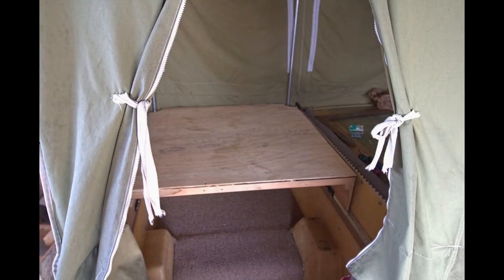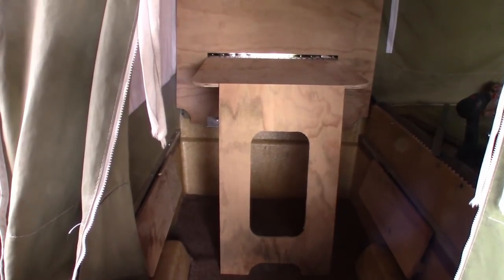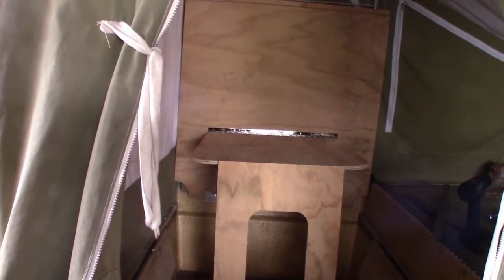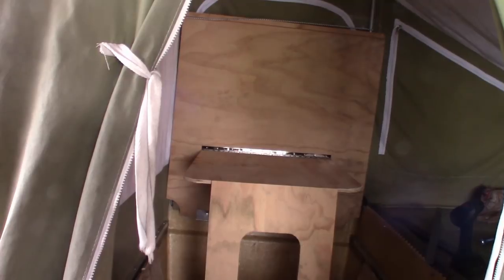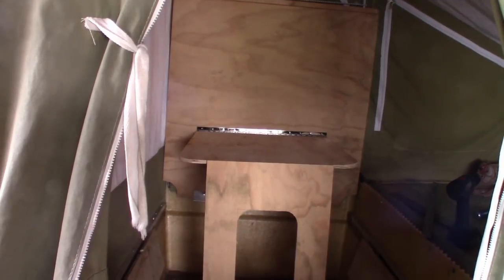The new bed is half-inch good-one-side plywood and I've put a three-quarter inch by one-inch maple lip and stiffener on it. There is my loose fitting of the setup of my table for the Minimate. A couple of minor things left to do, but we're ready to sand and stain.